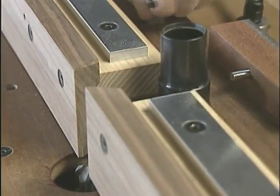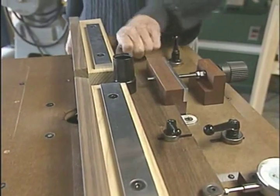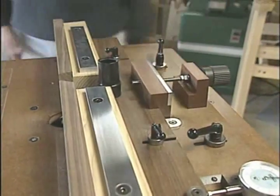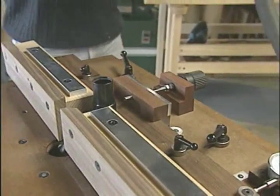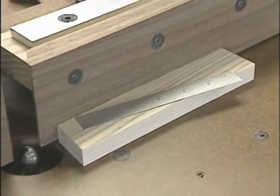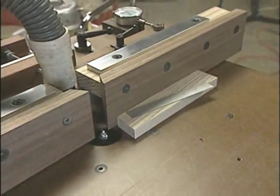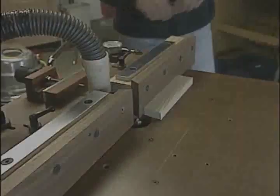From the simple to the simply terrific, this fully adjustable fence actually makes the process enjoyable. Of course, I'm partial because I designed it. There are 2 sections for adjustments, micro and macro, and the fence halves even slide left and right down to a 1-inch gap to minimize cutter exposure.